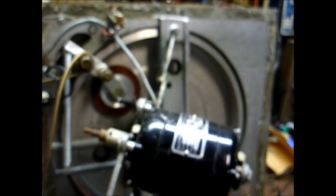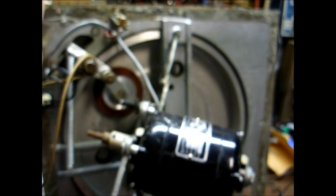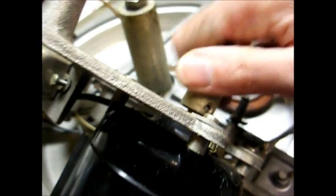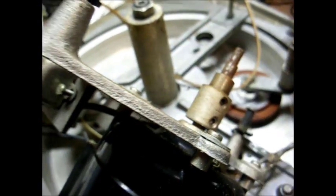I don't consider myself to be an audio fool, so I really don't care if there's a little background rumble — that doesn't make any difference to me. Now we will take this motor apart, clean it up, and see if it's salvageable. Unfortunately, this motor is seized, solid as a rock, which is really not a good sign, but maybe I can take it apart and clean it up. If this motor is shot, I can still get motors for these turntables, but they're a little on the expensive side. A new motor will run around $125 plus shipping.